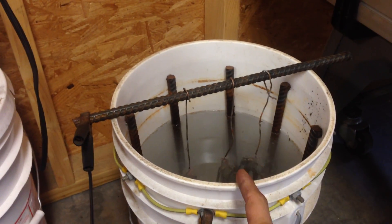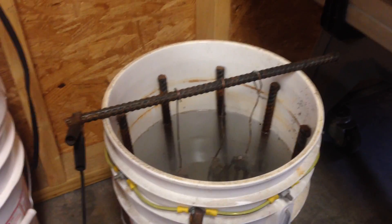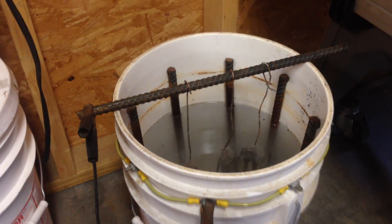In this water I've got about five gallons combined with a half a cup of 20 Mule Team Borax. You make a nice little solution and you hang your parts to be cleaned, and you start seeing all this magic. You can already see some stuff that's coming off in there. You plug them up and let it run.